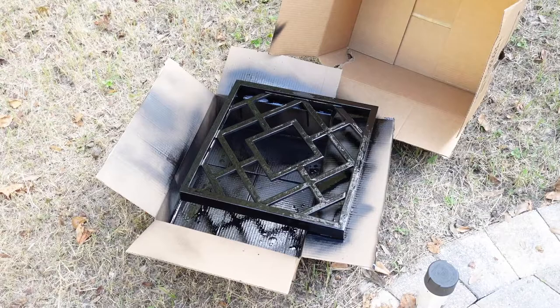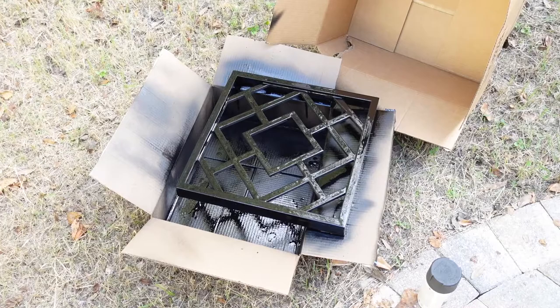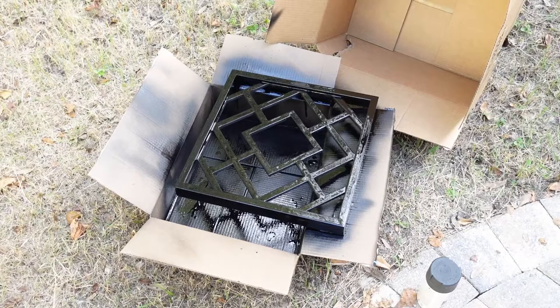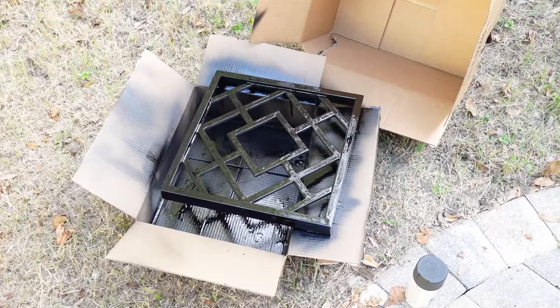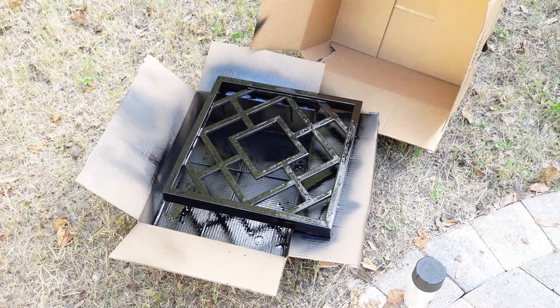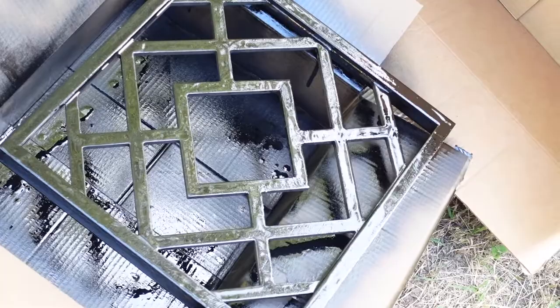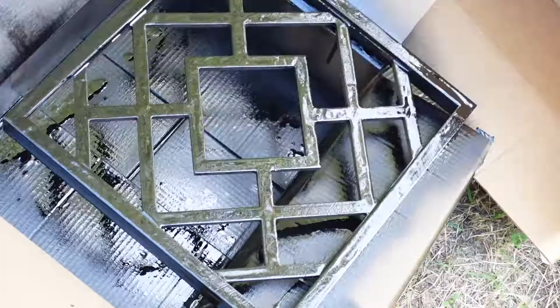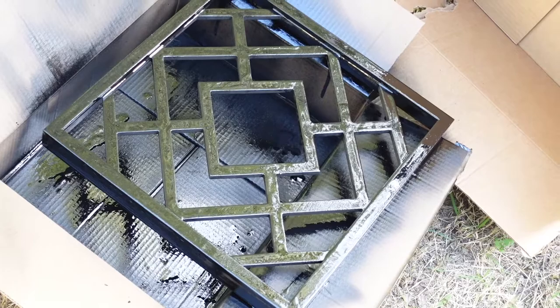Okay guys, so I finished painting. I wanted to give you a small tip here: this paint actually has a primer already in it, so I didn't have to apply a separate primer before spray painting. I realized that the initial coat gives you a matte finish because the wood absorbs the paint, so you won't get that semi-glossy finish right away. When you continuously spray on top as a second and third layer, then you get that glossiness. Can you see the shine? It actually looks really glossy. It says wait 20 minutes to be dry to the touch and then 24 full hours before hanging or handling.